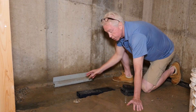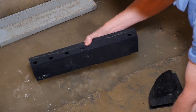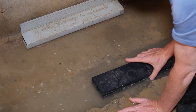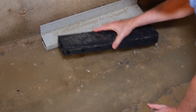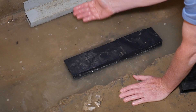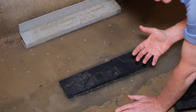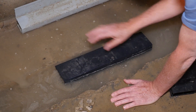So we've gone over how the gutter system works. There's another system out there we call it the box system for obvious reasons. With the box system the difference is that they put it just inside of the edge of the footing — normally the footing would end about here and the box system would be sitting right around here. But it's always within the depth of the floor, so you're still getting that same problem where the water has got to flood the entire area underneath your floor with the whole floor sitting in water before any water actually flows through the so-called drainage.